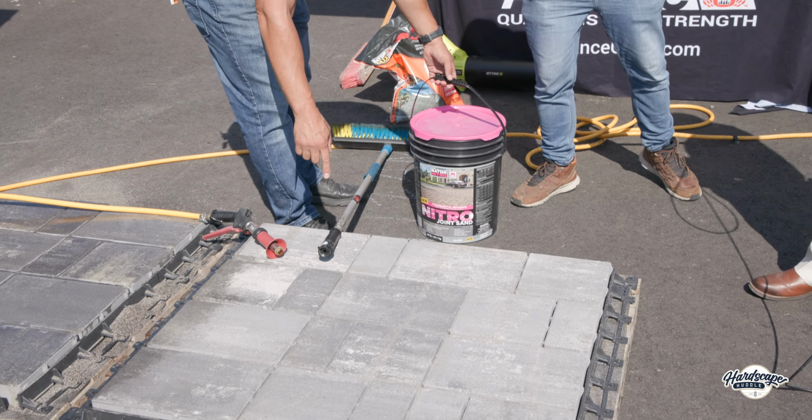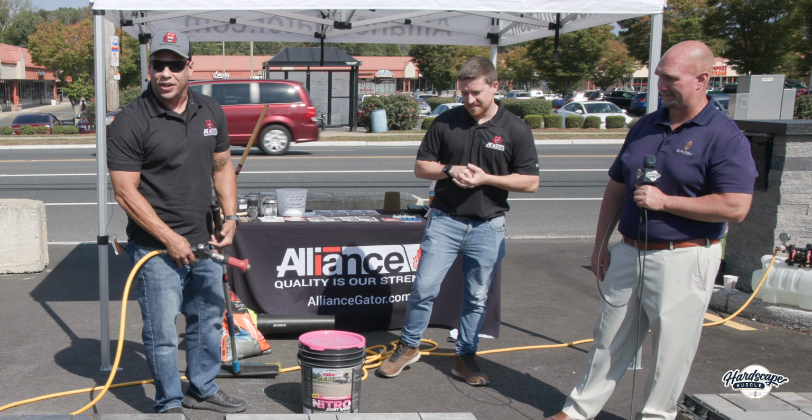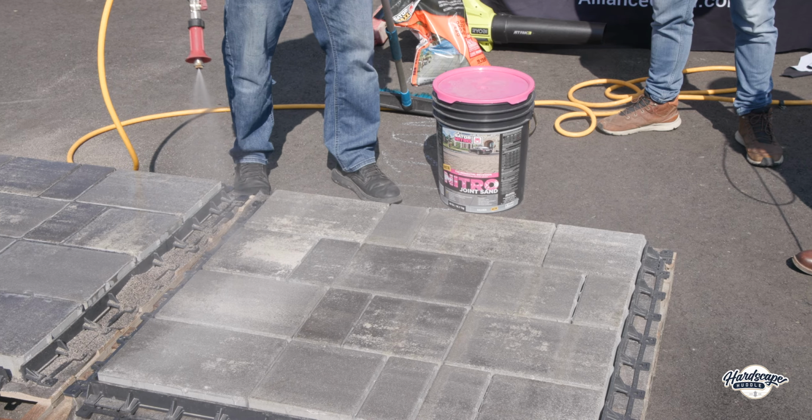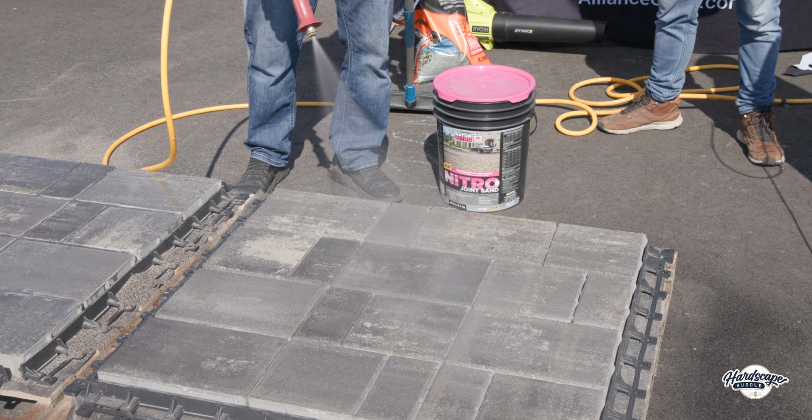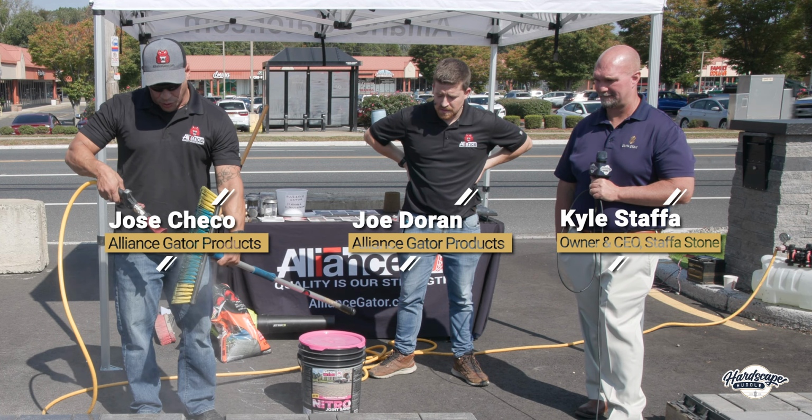Yeah. So no, you can't because we need to wet the surface first. So the first thing we want to do is make sure everything is wet. If you're going to be working alongside a wall, wet the wall. Most importantly, please wet the tools. The water's your friend here.